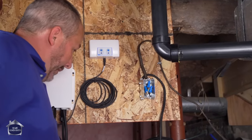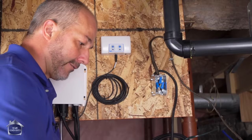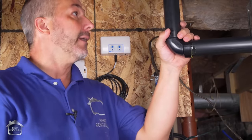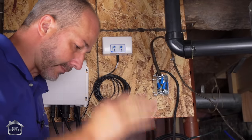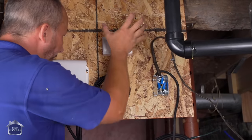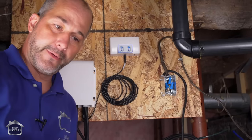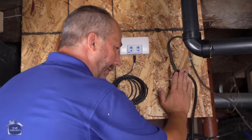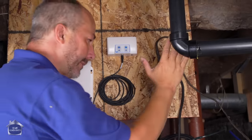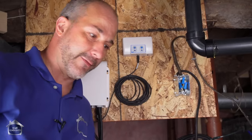Let's go through this one more time. We have our three-inch waste line here — that line has its own venting. We have a vent line specifically designed for the macerator — that's connected. Our discharge is connected, brought into the line — we have it up and over and coming back down into the line. We have our alarm set up and wired — that's not going to fall out because we took the weight off. Our power is now connected. The only thing I have left to do is flip the breaker, and I want to go to the store to buy a solid plate to cover for this. I'm not putting a switch or anything on this, but I do need to protect those wires with a steel cover that screws right into these holes.